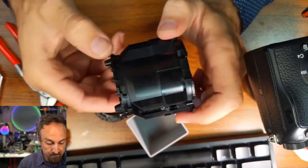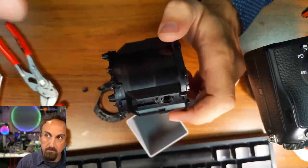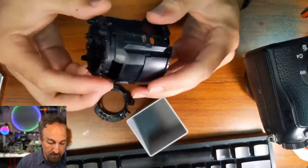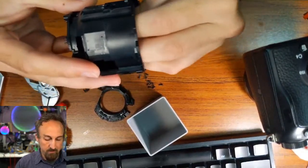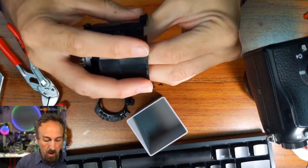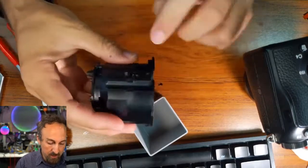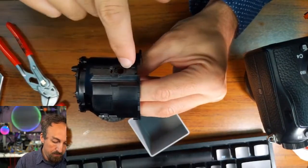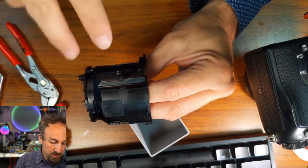But regardless, there is the complexity and the number of features which get milled into one or more mating faces of the mold, and then there are the actions. You have the primary mold on this part. Likely one face of the mold comes in from this side, the shell comes over the top, and then you have side mold actions. These are additional pieces inside the mold that push in. If you had this part held like this, you wouldn't be able to eject it because of this boss that made that hole there or there. Those pins have to push in, you do the injection, wait for the plastic to cool, retract, and then you're able to eject the part.